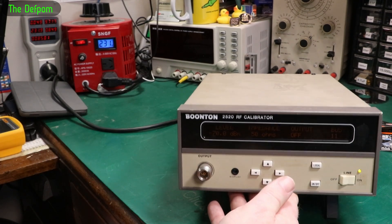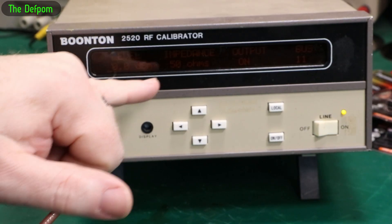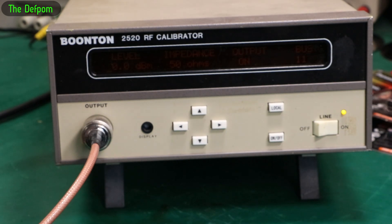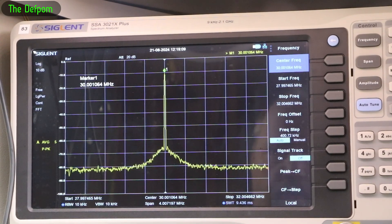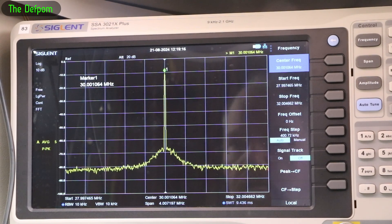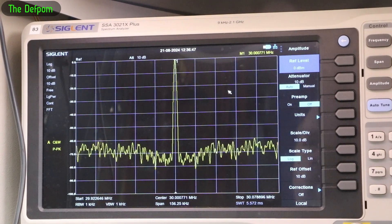The backlight looks good — you can actually see it quite well this time. Let's plug this into something and do some testing, see what comes out of it. I've set it to 0 dBm, output is turned on. I've got it hooked up to my spectrum analyzer through this cable. There's the spectrum analyzer — it's outputting 30 MHz. At 0 dBm output I'm going through a 10 dB attenuator as well as a DC block on the front panel — good things to always have installed on your SSA to protect the input. So we're currently getting basically minus 10 dBm, which is correct.